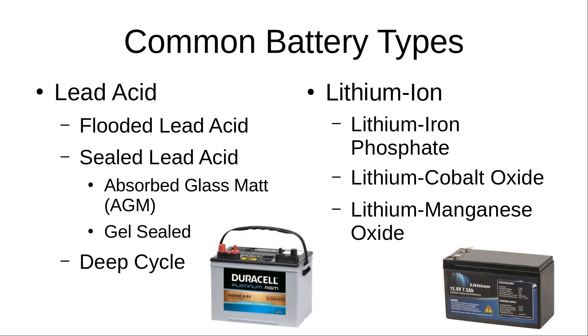The lithium manganese oxide battery has a lower cost and a longer life. It's moderately safe — safer than cobalt but less stable than lithium iron phosphate. These are used in high-drain devices like hybrid car batteries, high-output flashlights, and newer laptops. They're also very popular in the vape world and have high discharge rates. That said, if you're going to choose a lithium battery for ham radio, lithium iron phosphate is definitely the best overall choice.